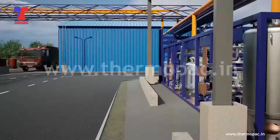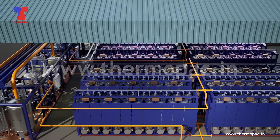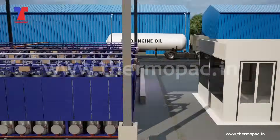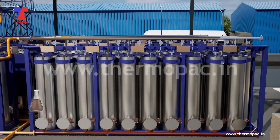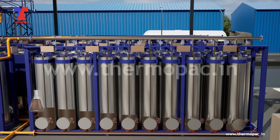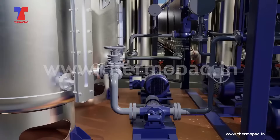The processed lube oil with a 5.5 ASTM color at 15 degrees Celsius is heated using thermal oil. It is pumped into columns with absorption media under appropriate pressure for polishing. If the oil's color exceeds the limit, it is redirected to a semi-finished oil tank or back into the input tank via SCADA. During regeneration, the absorption media becomes partially saturated, reducing the incoming oil's color, and this process continues, yielding oil above the color limit stored in the semi-finished oil tank.